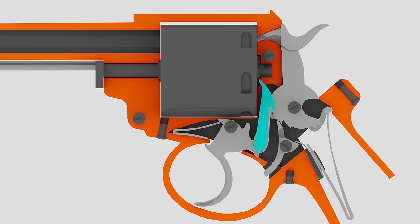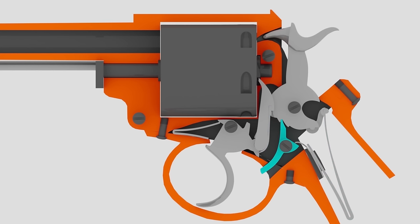Functional problems in the Mark I conversions resulted in some modification. The hand was reshaped and strengthened, and the flat spring that powers it received the same boost. The sears were also strengthened, though I'm unsure if this was dimensionally or with a different heat treatment. The arbor latch button screw was also made more secure, broadened, and no longer countersunk. The Director of Naval Ordnance approved these changes on the 20th of August 1872, so about the time that the Mark III showed up on the scene.